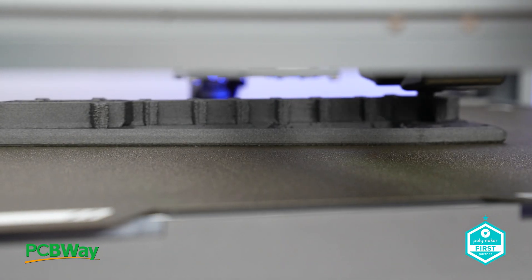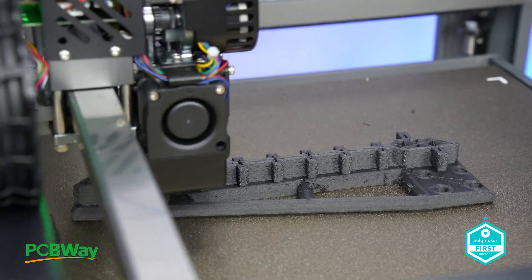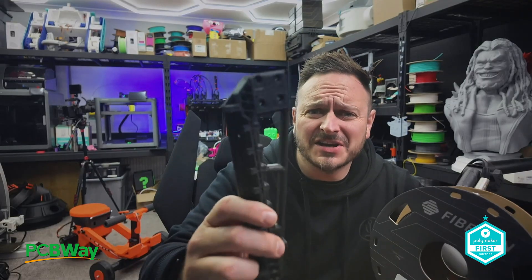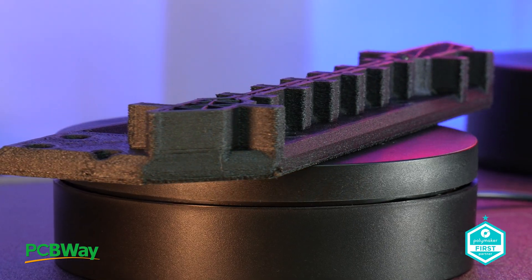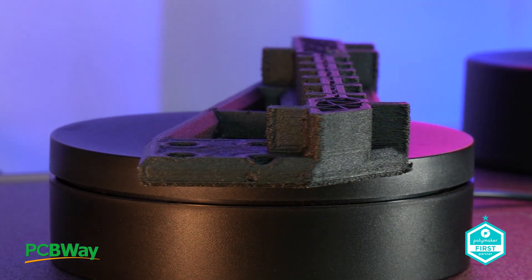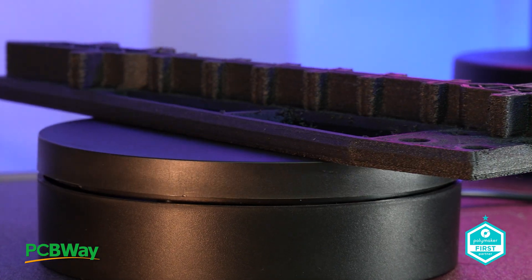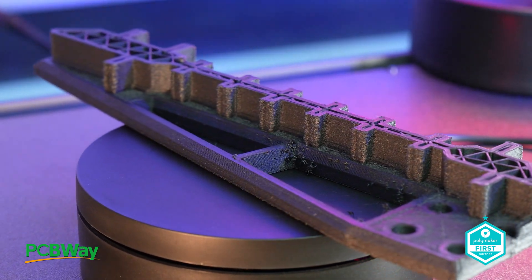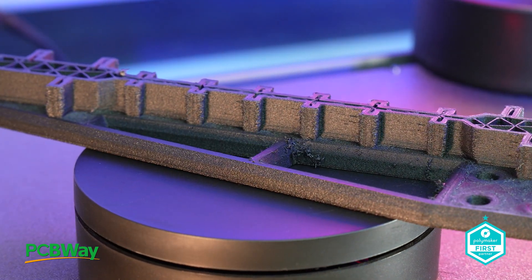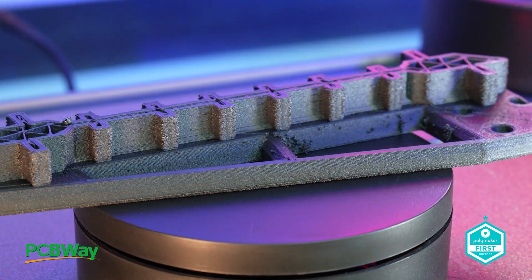So onwards — we print with this drybox. After a few bedding-in prints, I noticed I was getting some pretty bad prints out of the PETG carbon fibre by Polymaker. The prints legitimately looked terrible, so I played around with the profile to see what would be the best settings. But then I remembered that PETG is super sensitive to moisture, and the plan overall is to use this machine for industrial printed parts long-term. I think I might have left this PETG out on the table for around about two weeks, so I needed something to dry it with.